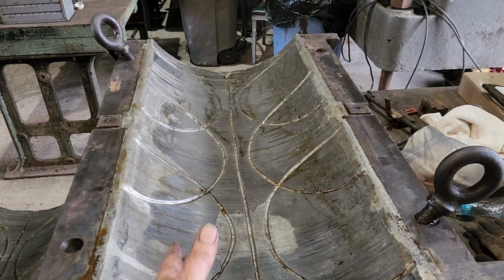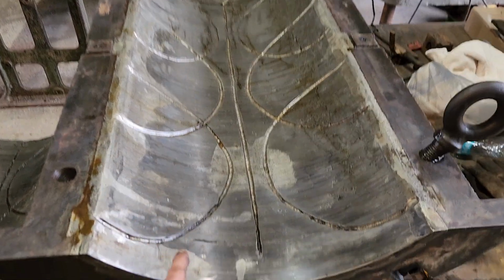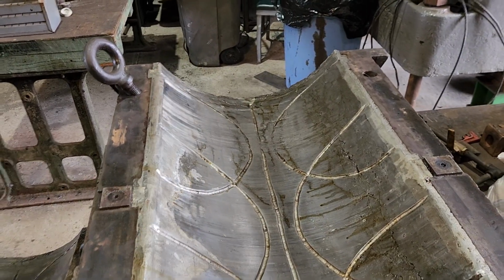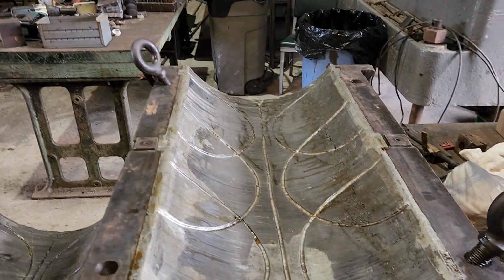Well, if we were to make this cylindrical on a mandrel, you'd put it in, and the bearing would touch at this end and touch at that end. It wouldn't touch in the middle, and anywhere there are little undulations in the diameter, it wouldn't touch. It would basically run hot. It would be worse than just using this.